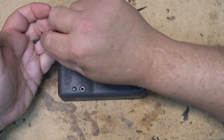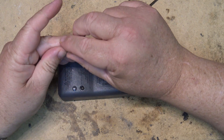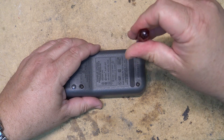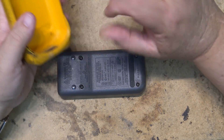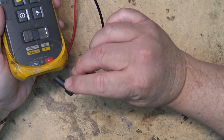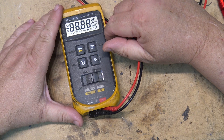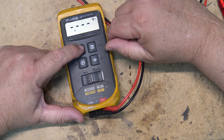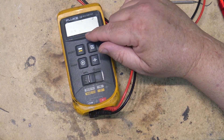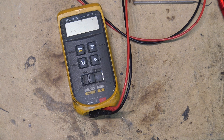I've had this meter for probably close to 30 years. I bought it at one of the first ham flea markets I went to — probably 1990, 91, or 92, early 90s — and I paid ten dollars for it. It's been a fantastic little meter over the years, other than the fact that I've had to fix it a few times. So if you have a problem with the buttons on here, it's going to be that little conductive strip. Sometimes you just have to put a little more solder on the pads to raise them up slightly so they'll make a connection. Thanks for watching — we'll catch you in the next one real soon, bye.